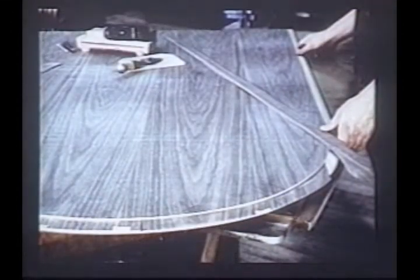The beveled edge around the grand top is not a yellow poplar core stained a walnut color. Much to the contrary, we apply a genuine walnut veneer matched from the same flitch. A nice tight shot of the matched bevel and top veneers. The bevel veneer is inserted into an undercutting to lock it down in position.